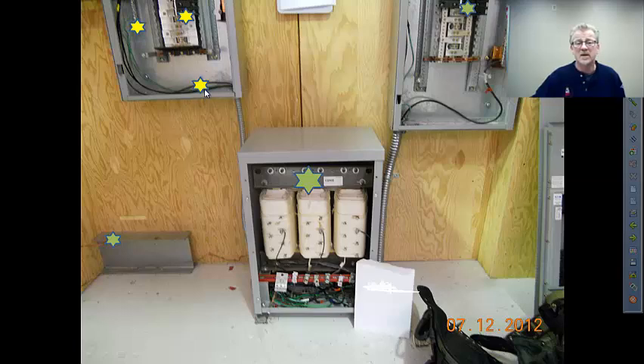Then you're going to size conductors with enough ampacity, and here's where you can apply 240.4(B) next standard size language. Also size your 250.122 equipment grounding conductor and equipment bonding jumpers. Grounding electrode conductor per 250.66, based on the secondary conductor size in AWG. Your secondary conductors are sized large enough that they are protected by the downstream device, and there is no next standard size language in the 240.21(C) tap rule — whether it's the 10-foot or 25-foot tap rule.